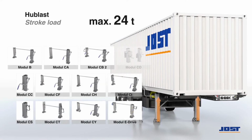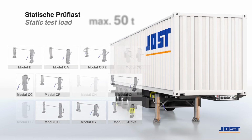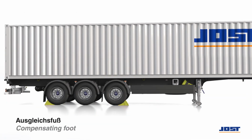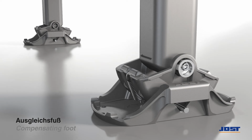The lifting capacity of this landing gear is 24 tons per set. The static test load of this landing gear is 50 tons per set. The static test load of the module CH, CK and CS ranges is 66 tons per set. Landing gears for trailers with air suspension are equipped with compensating feet of type A or S.